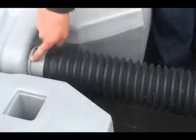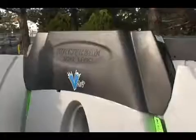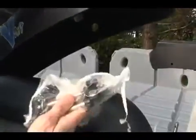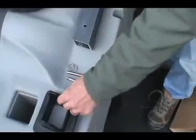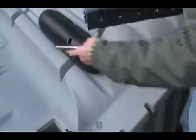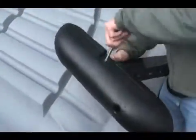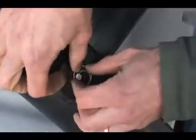With the tanks attached, it is important to inspect that both pins are inserted. The inner bunk and the hardware are stored underneath the lid. The lift has two different pin lengths: a four-inch pin for the axles and the seats, and a five-inch pin for the inner bunks. To assemble the inner bunks, simply place the leg in the bunk, insert the longer pin, and add the ring to lock the pin in place.